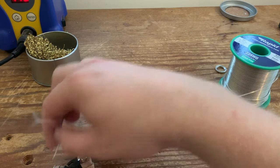Oh, actually, the one thing that I can't do, which you do need to do. So I'm gonna send this back to the customer tomorrow morning, and he's gonna have to connect the main ground wire coming from the bridge. As it's on his guitar, I can't do it for him. And then your ground from the bridge, you just need to put anywhere onto ground. So the best place, the nearest place as well, is probably going to be the neck volume control. So just solder your ground wire to the back of the pot casing. Screw everything back down. Plug it in. You're ready to go.